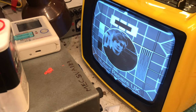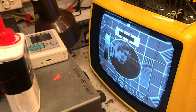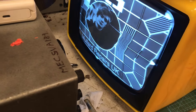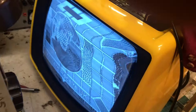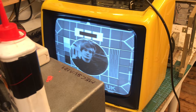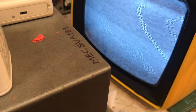I've got a couple more caps to do. I've sorted out the centering — it's a bit better now. There's no width control, so it's pretty much dependent on what the HT is set at. I've cleaned the tuner and it seems to be working fine — I can change bands. You just have to make sure the band is selected correctly. There's no focus control that I can see; I think it's just fixed. Focus is pretty sharp after I've adjusted the HT anyway.